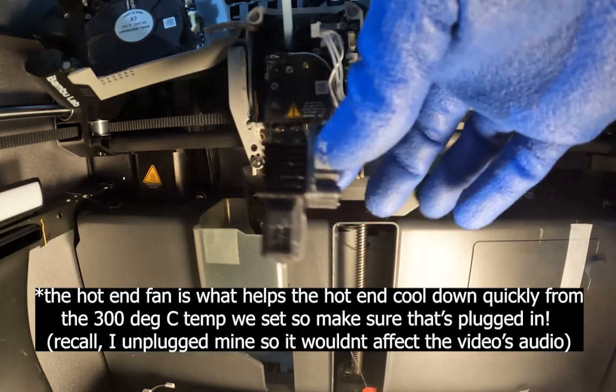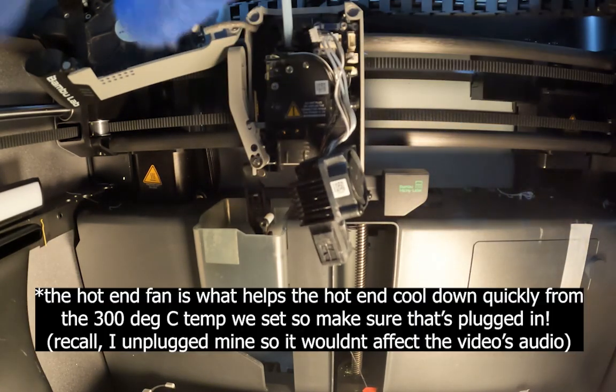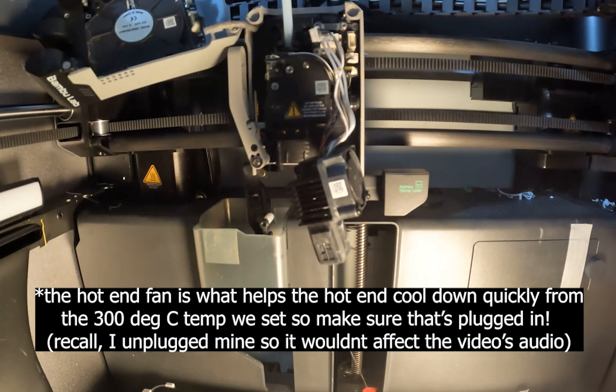What I can do is just let this cool back to room temperature and reinstall it, reinstall the cover as well, and I'm good to get printing again. A lot of the clogging I was experiencing while printing PA6CF was because of heat creep. This is a high temperature material in an enclosed chamber. If you don't have proper cooling for your hotend, heat creep can occur where your filament starts melting too soon, causing clogging. After a few slicer changes, that did go away.